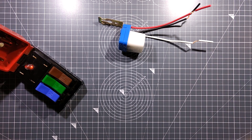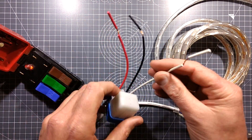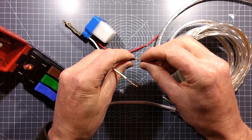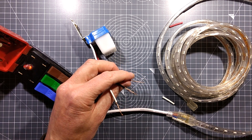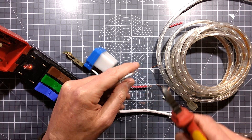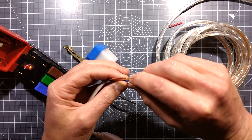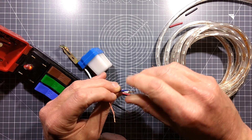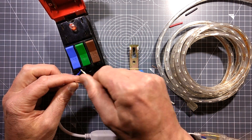Let's find something to connect with this. I'll use it with the LED tape, because this would be perfect for bringing your LED tape on at night outside. Let's strip these off. It's twisting quite well - is that copper? Maybe. I'll crop them down a little bit because they're a bit too long. So that's the load, that's the live, and this is the neutral. However, this isn't twisting too well - I think this is aluminium cord wire, which is disappointing. Aluminium has never been a great metal for electrical connections, and even the copper coating I'm a bit suspicious about.